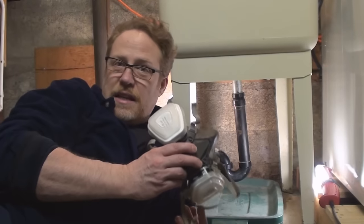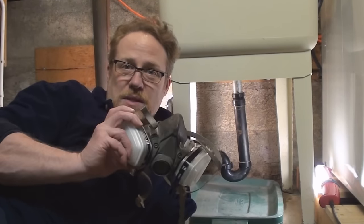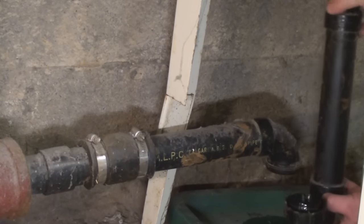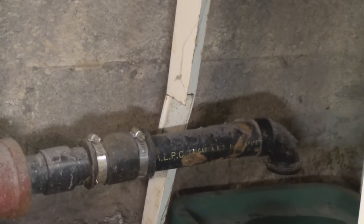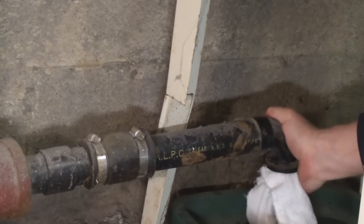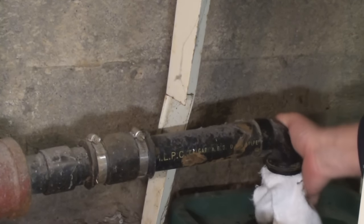This time I'm going to be wearing my respirator with the organic cartridges on it. Although this isn't a toilet outlet, it is connected to all the other toilet outlets in the neighbourhood, and the smell coming out of it is just ferocious. You're going to want to ventilate the room well. I've already loosened off the top nut with the channel locks, got my catch basin underneath, and I'm undoing it — out it comes. To my surprise, the elbow is completely clear. The problem is further downstream. Before you do anything else, shove a rag in to plug that hole, because you get sewage gas smell coming up when there's no water trap to stop it.